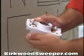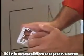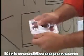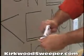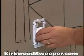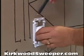Take a wall mounting bracket, cut or snap off the new construction flange, and dispose of it. In new construction, nail the tab to the stud. Use a level, then measure and create a precise box using these dimensions.